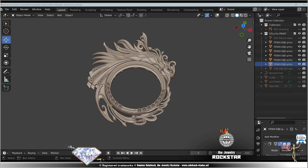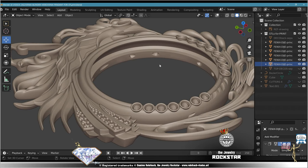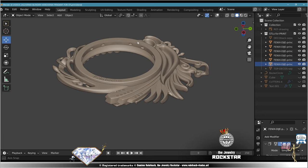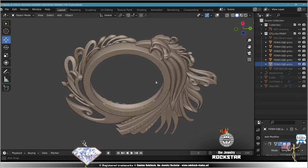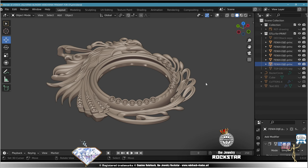Before you print, you might want to prepare your file. Check that the Booleans are all right, that you have all the objects clean as you want, check the quality, check that every piece is of the correct thickness. Just check that your model is clean.